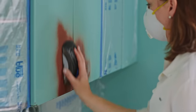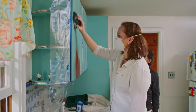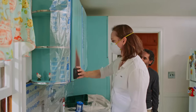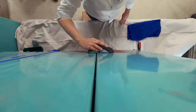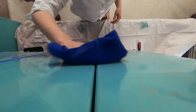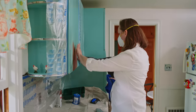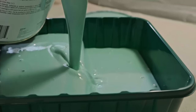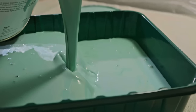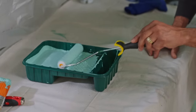Now we're going to sand the cabinets with 180 grit sandpaper, just to score the surface a little bit. You can turn the sanding pad to make it easier. Keep going. Now we're going to wipe that off with the rag again. This looks really nice. So what we're using here is called DTM — it stands for direct to metal. Just dip your roller in there — don't load it with too much paint because we're going to do multiple coats.